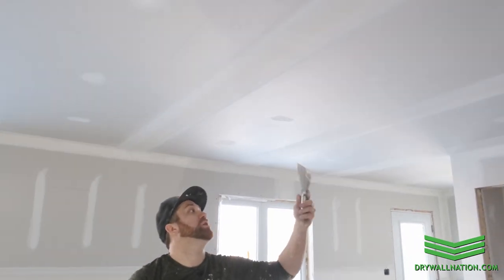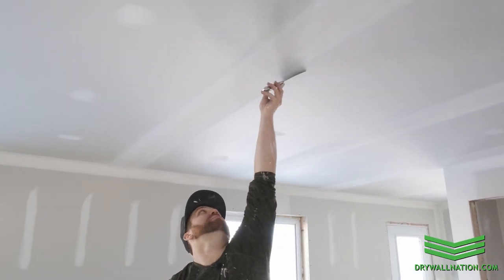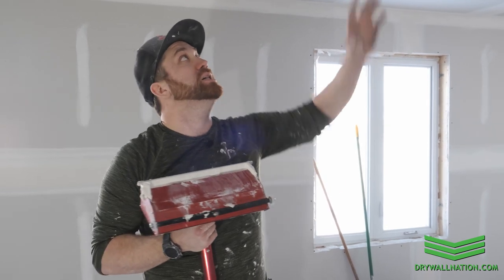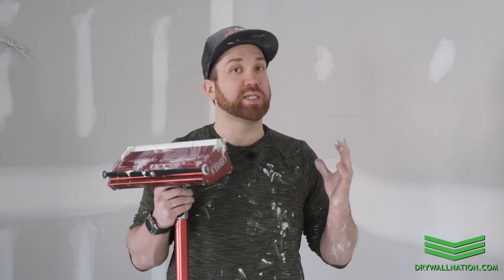If you take a look at these seams here — we just did these about 10 to 15 minutes ago and already they're starting to set up quite nice. If I run my knife across there you can see it's not leaving any type of drag marks. That shows just how tight of a skim we're leaving with our flat boxes. I like to run my 12 inch a little thinner and leave a much tighter skim coat — my fill coat or block coat is on my first pass with my 10 inch box. So I hope you enjoyed that quick video on how to run your 12 inch flat box for skimming your walls and ceilings. For more tips and tricks check out our other educational videos with Level 5 Tools. Thanks for watching.